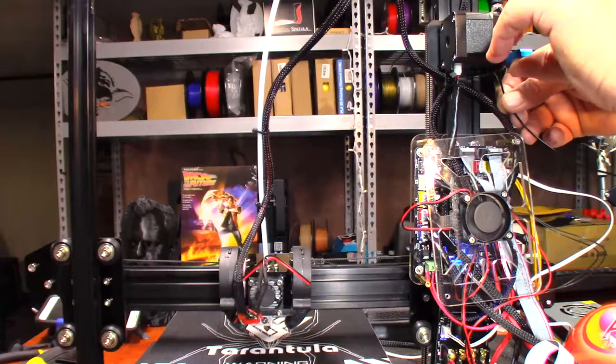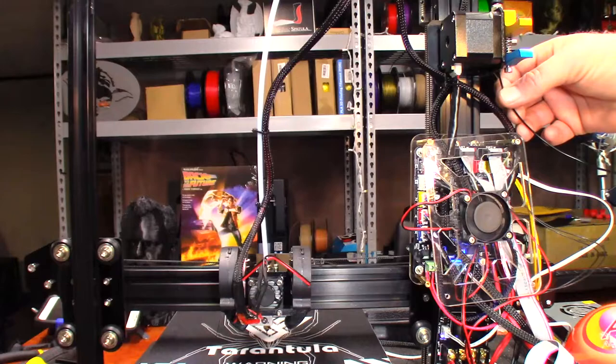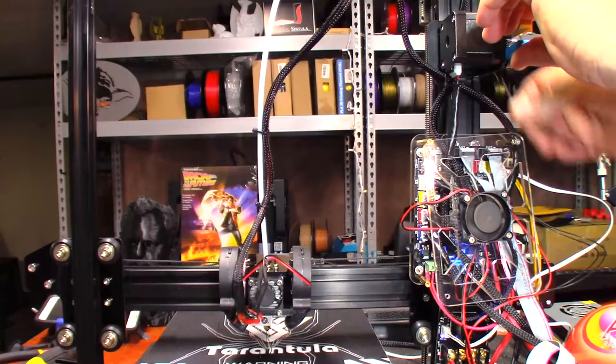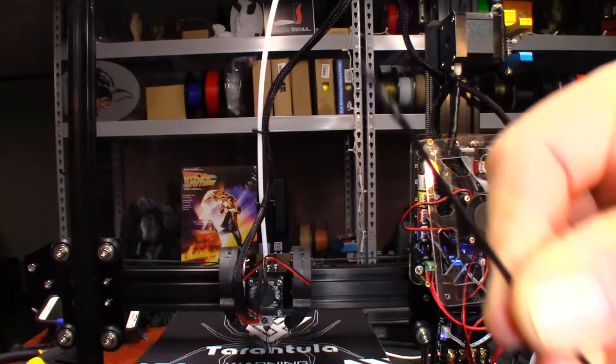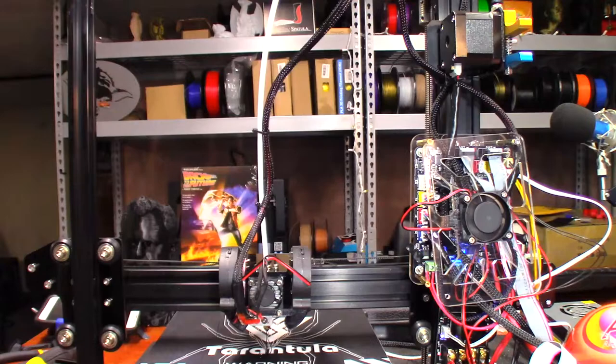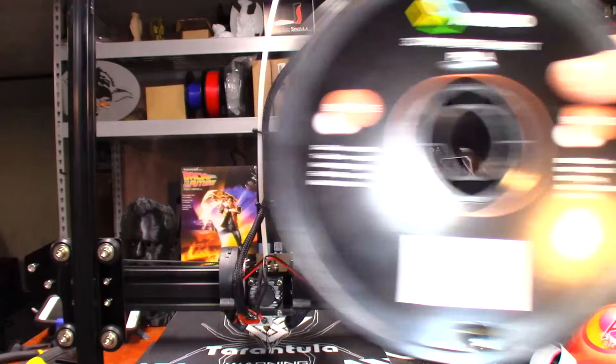We're currently sitting at 180 degrees Celsius. What I'm going to do is extrude a little bit of this PLA — this is kind of the lowest temperature I can really extrude at, which is fine for this filament. I'll extrude a little bit, and as you can see it's coming out the nozzle. Then I'm going to quickly pull it out — by quickly pulling it out it creates what looks like an indentation of the nozzle itself. That's my way of cleaning out the nozzle. I do it on every printer whenever I change filament. I've had some pretty good luck doing it that way even with Bowden tube printers.